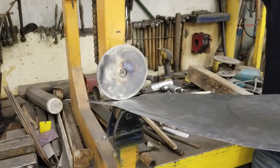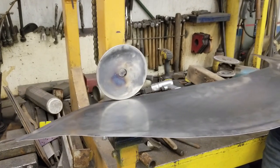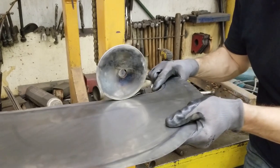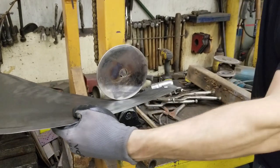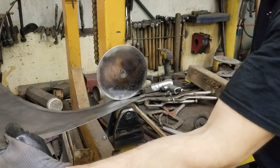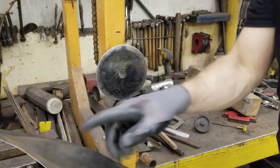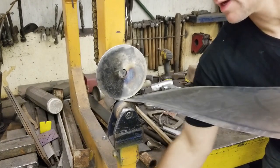I'm going to roll this through. As I've been handling the panel, I've actually wiped off the Sharpie that indicated the edge width — but there's enough there to get us by. Okay, so that was the first pass. It kind of broke the edge for us — that's the hardest pass. After this, the wheel will run within that track and we can roll it up the rest of the way — at least most of the way.